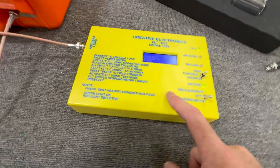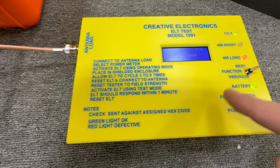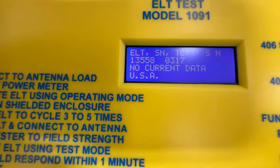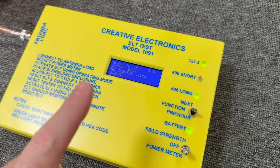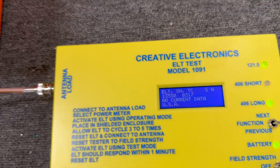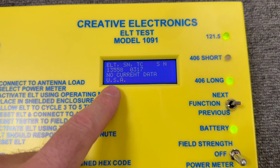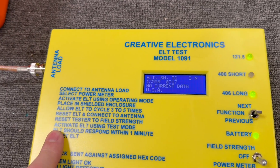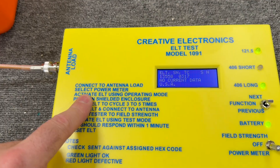What's in here is actually a very low-grade AM radio — that's what you want to use to do the test for 121.5. I did get one 406 burst that came through. I'm going to let it cycle a few more times and check my data. Now that it's putting out 406, it's giving me all the data. It's showing good tests on both frequencies. It's telling me the type of beacon, the serial number — no position data — and where it's registered. I'm getting good tests, and this thing is passing the signal strength test through the antenna.